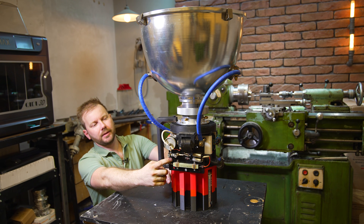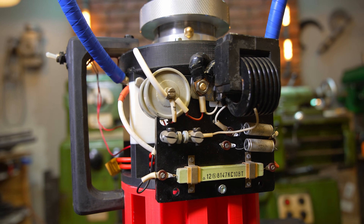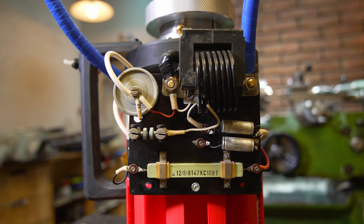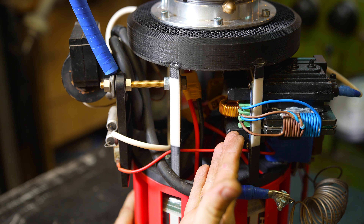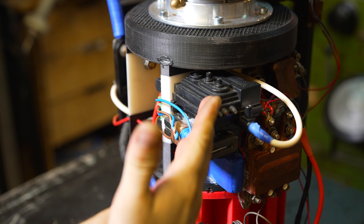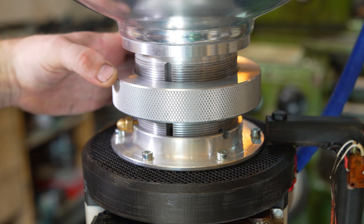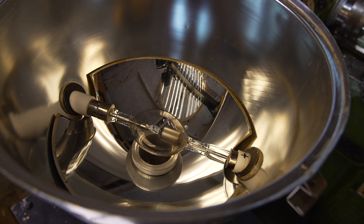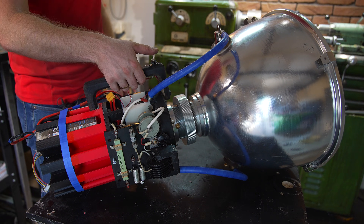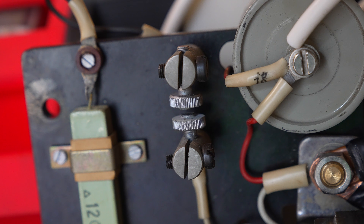I created this block myself earlier, but for this occasion I opted to use the KP-23 film projector. Inside you can see a ZVS driver powered by 24 volts — it is needed to energize the high voltage transformer. When rotating, the parabolic reflector smoothly rises or lowers depending on the required beam type.